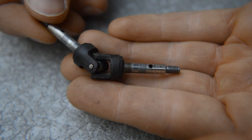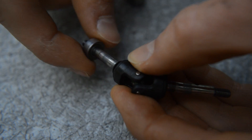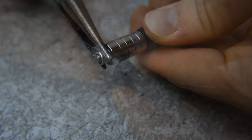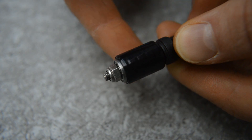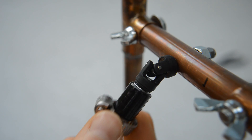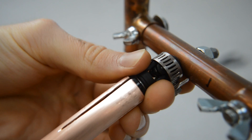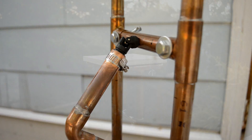To finish the handle, I chopped three grooves in the uncapped end for more flexibility when securing it, and used sandpaper to remove the burrs. For the universal axis, I used two RC car joints clipped together in the center, threw some bearings on one end, secured them in place, and used electrical tape to bulk up the diameter to about half an inch. I secured the other end into the mounting hole in the frame, and used a hose clamp to secure the handle to the taped-up bearings.